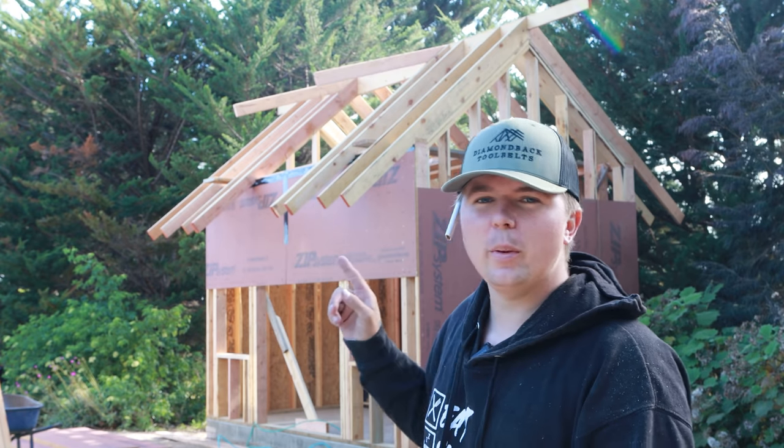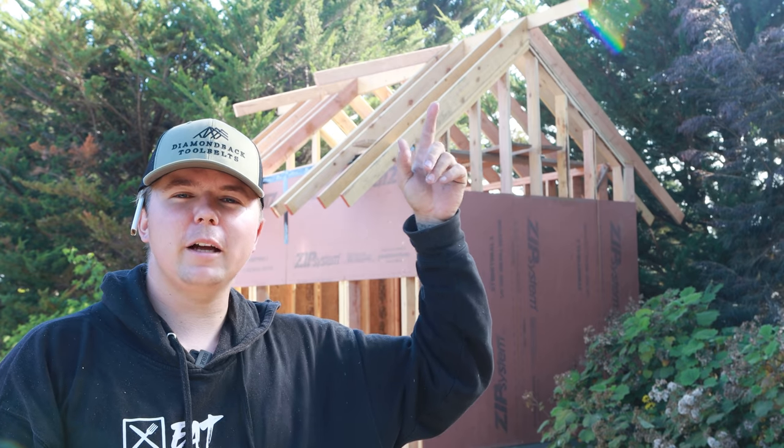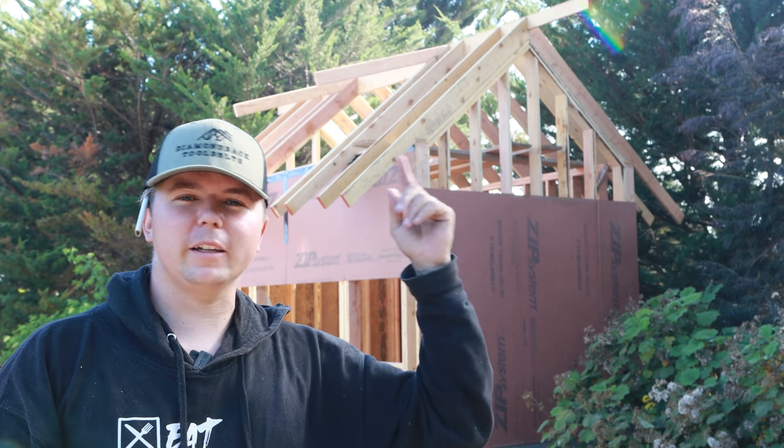We were working on the shear panel here out front just before calling it quits. Tomorrow, they'll wrap up the shear in the front, fascia around the thing, prep it for roof sheathing. And the dormer up here, we agreed that it would be best if we leave the whole thing open there like a skylight. Once the roof is sheeted, come back, plate it, frame some walls, and stack that little thing out on top.